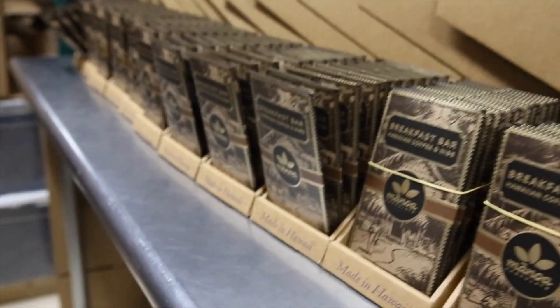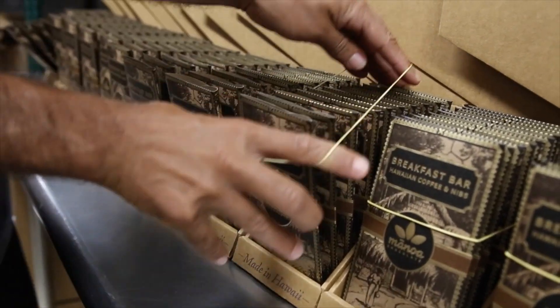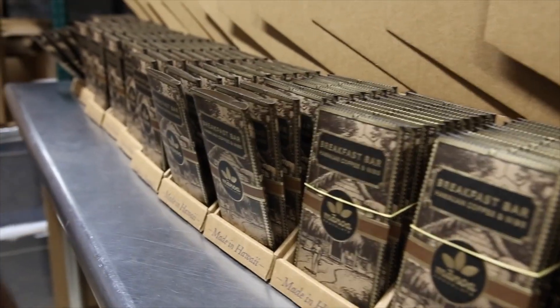That's an important consideration when you're designing your package, because it's difficult to change as you get bigger. Everything is set to certain sizes, so the last thing you want to do is change the size of your package because this package is already designed for the next case, which is designed for the master carton. It's all possible, but it becomes more challenging as you grow because of the scale at which you're operating and the amount of inventory you're sitting on — plus changing dies for cutting whether it's your package, your case, or your box.